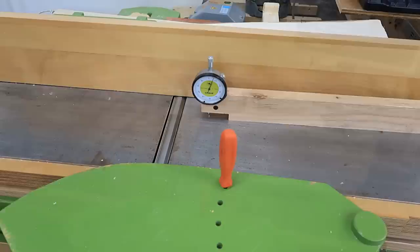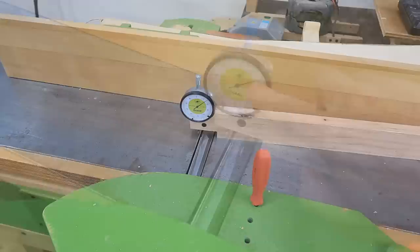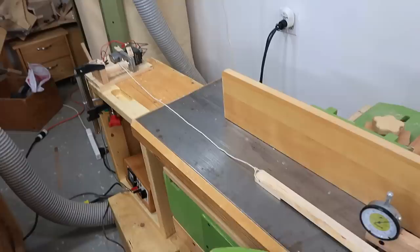But first I have to do the before tests with the old head. I have it set up to remove 1.2 millimeters of material — the dial indicator is metric and each turn is 1 millimeter. I'm going to measure power consumption using a smart plug and a computer to record and graph it. And to ensure I pass the material across at a consistent rate, I've got this little winch operated by a foot pedal that'll pull my stock across using this hook.